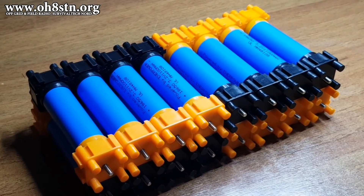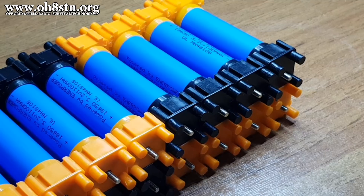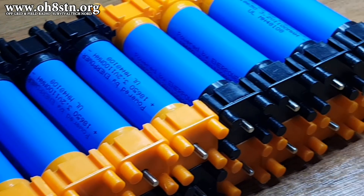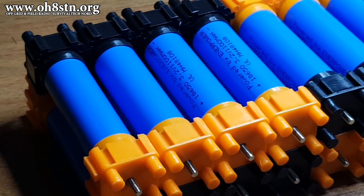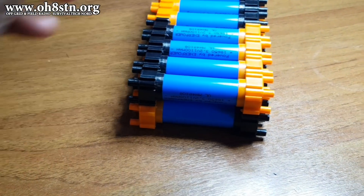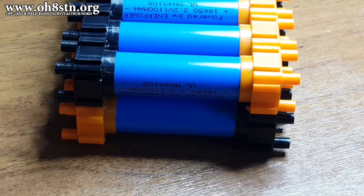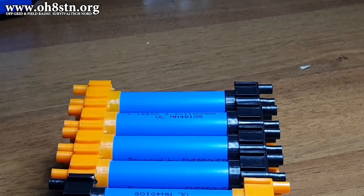This is what our 4.4 amp-hour pack is going to look like before the bus bars are on but with the end caps put together. The end caps have four sides and each side has either a slot or a channel. During installation, we need to maintain continuity ensuring the slot on one side and the opposite channel on the other. One end of the end cap is always an exact opposite of the other, and the slots and channels maintain their continuity throughout each layer. The only time we reverse the end caps is after we complete a layer and go on to the next one.